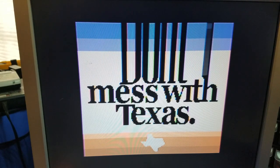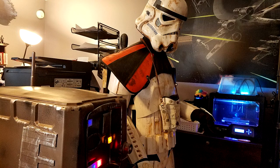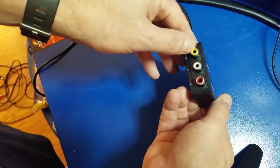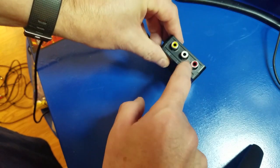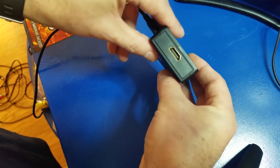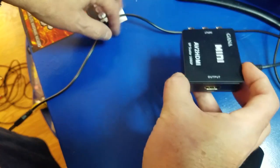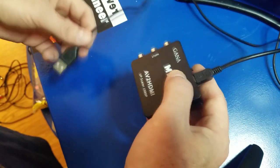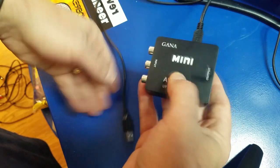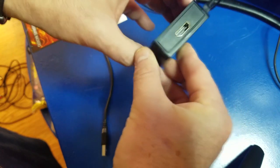That's an impressive monitor — I like it, I'll use it. Now, moving along: another adapter you might be interested in is this AV to HDMI. Basically, you take your video signal and plug it into the yellow port, and then you have left and right audio — with the TI we only have one channel, so you plug into either of those. It outputs to HDMI, so you can plug in your HDMI cable and hook it up to a modern TV. I'll put a link to this item in the description; it did work very well. Like the video-to-VGA adapter, it also has a small USB cable to power it.